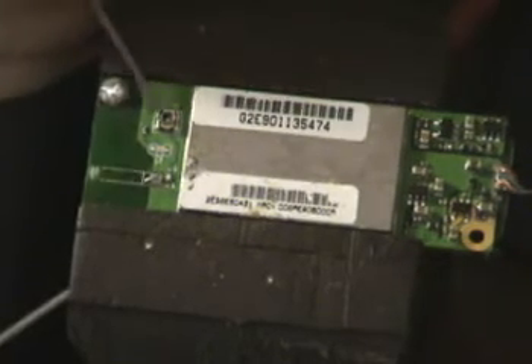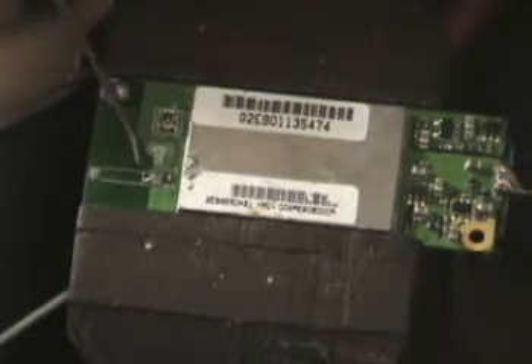Here is another very inexpensive USB WiFi stick — I have no idea what chipset or who makes it. But if you notice there's a test jack over here that looks very similar to a Hi-Rose connector. However, if we try to put a Hi-Rose or UFL connector in here, it won't stay. Underneath here there's a track that leads to this test connector, leads away into some passive components, and then what used to be another one of those inductor coils, which I've removed because of previous projects. Over here is where you'd solder your signal, and using the shielding — you can see where I have a little bit of solder — I've used it as shield. It's that simple — as long as you have the coax and the soldering capabilities, this is very simple.